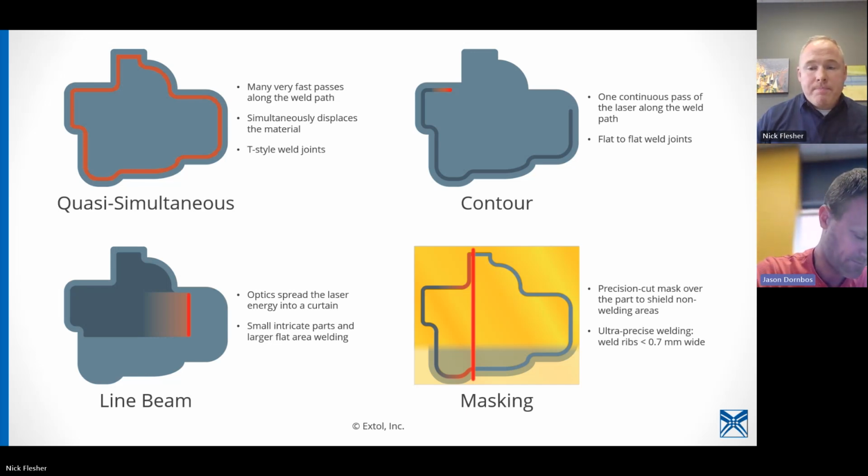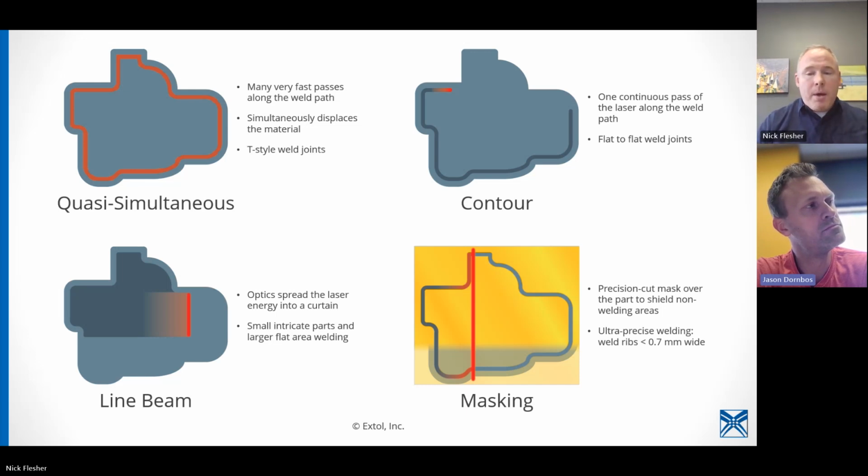Amorphous and crystalline both can be laser welded. Weld quality and strength, I would say, are application and weld geometry dependent. How planar does your weld need to be? The answer on that one is, how big is the part? If the part's a little bit larger and you keep it 2D, about 3/4 of an inch is how planar it needs to be. That's only if you use one laser source. We can use multiple sources and scanners.